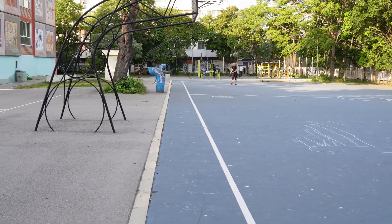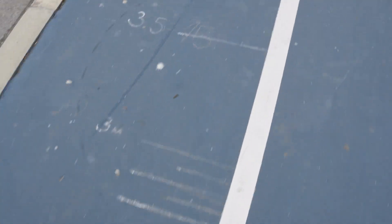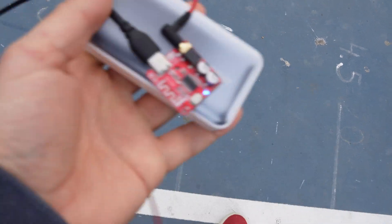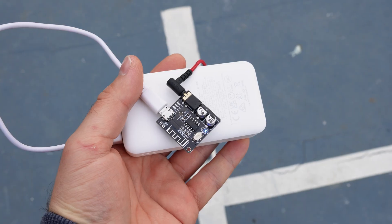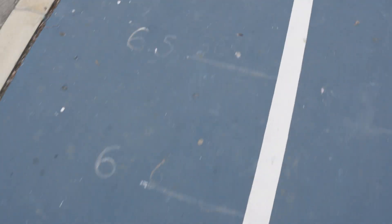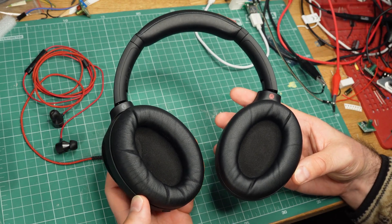To test the Bluetooth range of my receivers, I took them to a testing facility, plugged a pair of headphones into the receiver, put on some music from my phone, and started walking away. At just 4 meters, the red module started to cut off, and at 6 meters the music stopped completely. The other module did much better — the music got choppy at the 8-meter mark and was completely out at about 12 meters. Both receivers have considerably worse range compared to quality Bluetooth headphones. The 6-meter range of the red module is just not good enough, even for something this cheap.